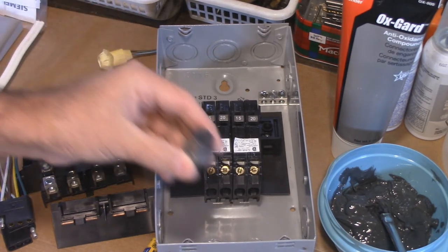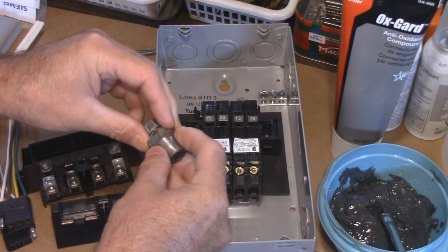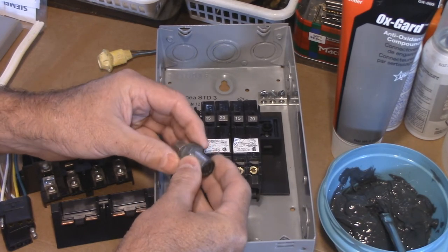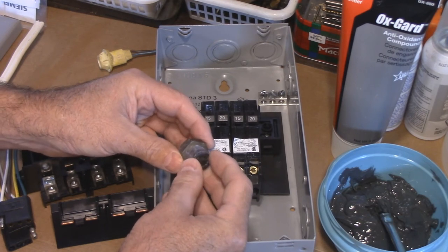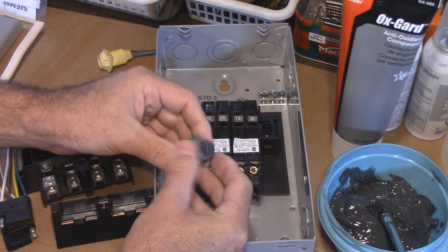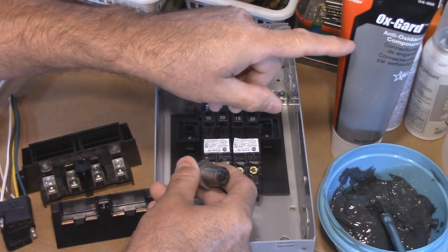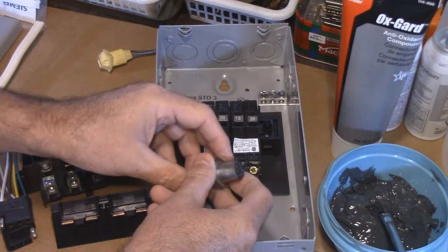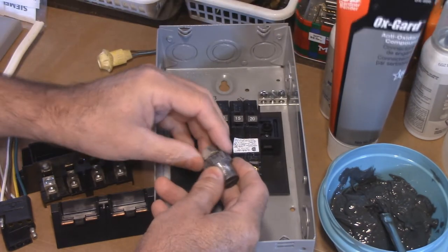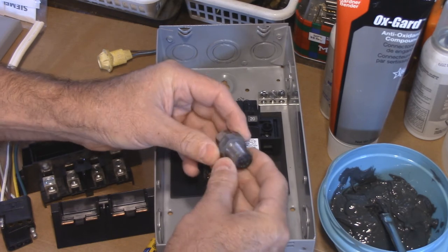This is like the post on the outside you see on a battery. A lot of people used to use dielectric grease and smother it all over the outside here. But dielectric grease is not conductive, so why bother using something that's not conductive? It still has the same properties — it keeps out the moisture and it's good at repelling as much corrosion as possible. But it's not conductive. So for me, I'll just go with this product here because it's conductive and it's far superior to using the stuff that is not conductive. I just put this on here, smother it along the top a bit, and just make it weather resistant and waterproof.